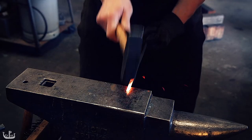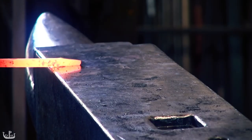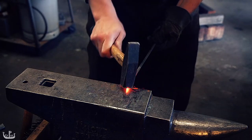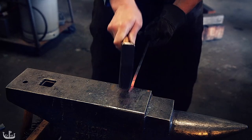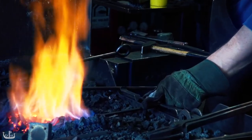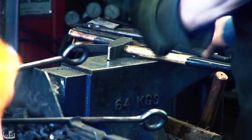It takes me a long time to even make a single nail. Anyone who does this professionally would have been able to turn out the nail in a single heat. I am setting the shoulder by using half faced blows on the edge of the anvil. The nail is then tapered until it has the right length and diameter so it will fit into the nail header.